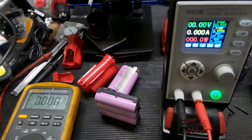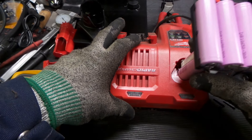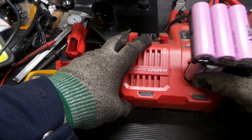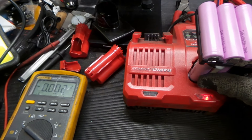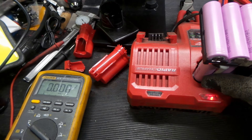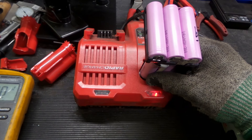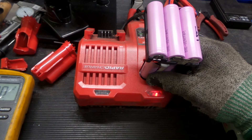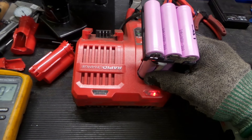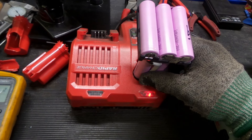I don't think those cells are necessarily going to be bad. Let's turn the power supply off and see what they're at — yeah, I think we're okay. Let me get the charger in here. Ideally you wouldn't be doing this with a rapid charger, but you know, work with what you've got. You've got to get them just right — if all those contacts don't make at the right time it will fault. What I'm waiting for is this battery would fault before in about a few seconds. It does not appear to be doing that. I believe we got it — so now we're going to put it back in its case and put it in the slower charger and see how it reacts.